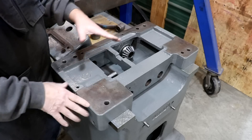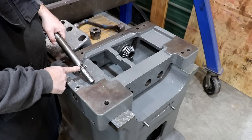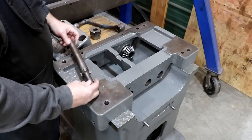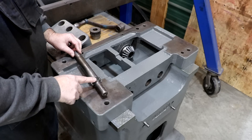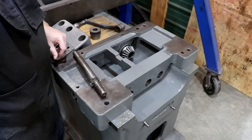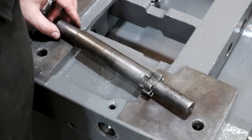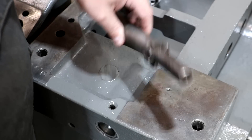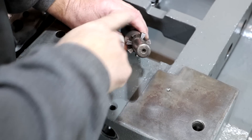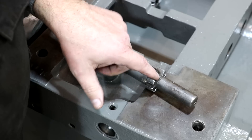So when I was working on this and taking it apart, I pulled this shaft out. If you notice, we're missing a tooth on this piece where that handle cranks on it. Probably not a huge issue — it'll probably work just fine like it is — but hey, we got it apart, now's the time to try to fix it. And here's a closer view: you can see the spline on the end that the handle fits up on, and we are missing a tooth. Don't know what happened, but it has definitely been broken off right there.